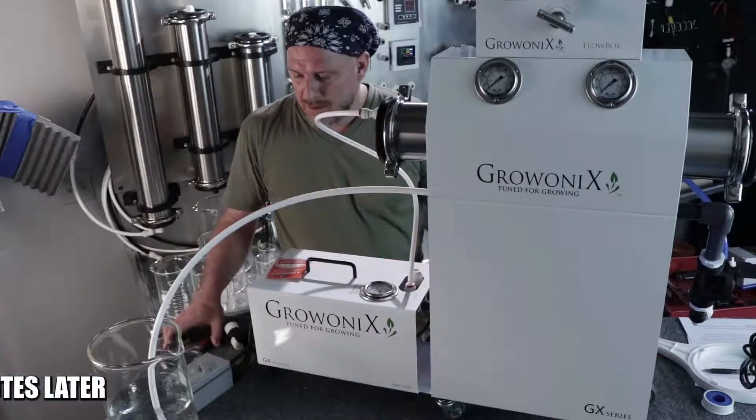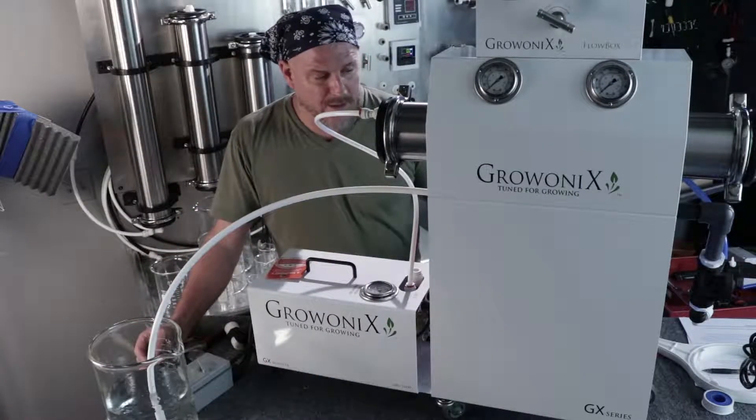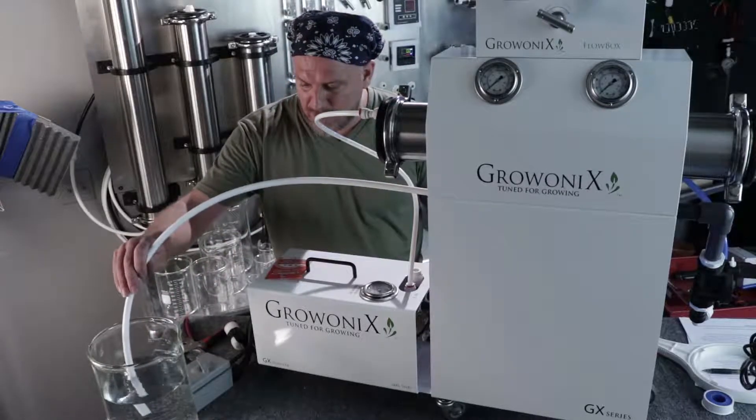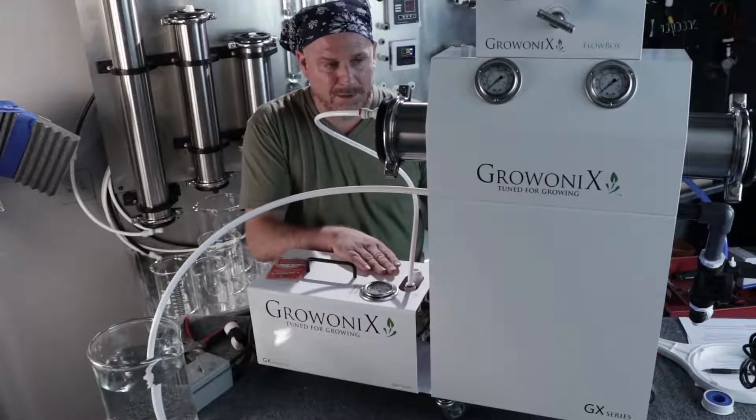A good flush and bedding it overnight really is the best way to do it. But if you need to make water, just make sure you flush it for 20 to 30 gallons until the water is clear. Here you can see the water coming out crystal clear — that's water that has been sediment filtered and carbon filtered with no more carbon fines. Now it's ready to be plumbed to the rest of the unit: the pump and the membrane.